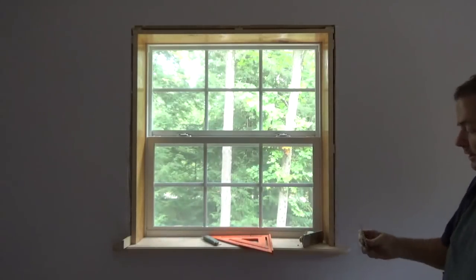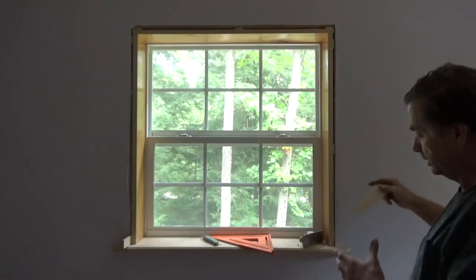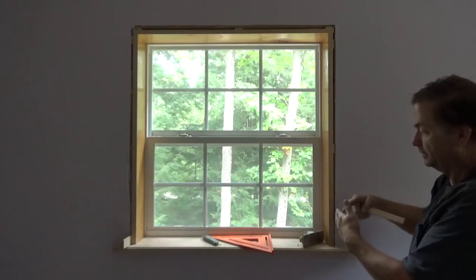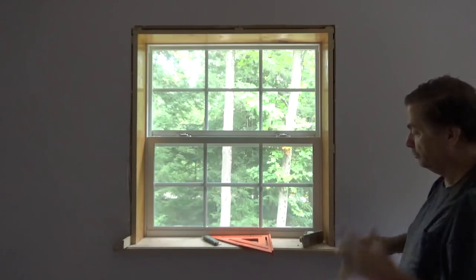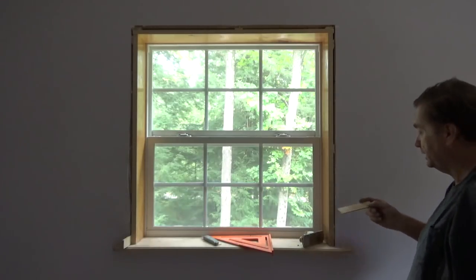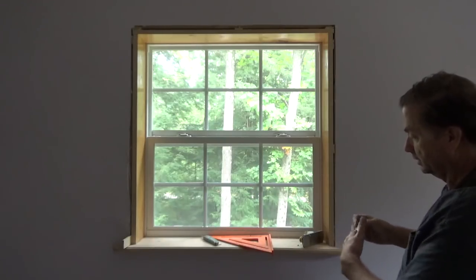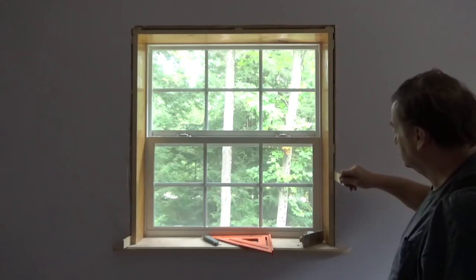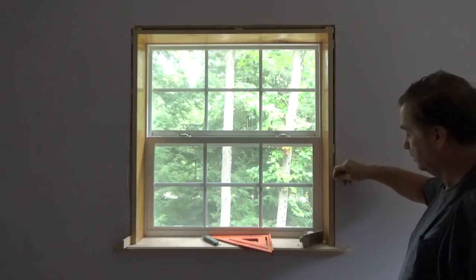Also, guys, there's an exception to every rule, and here's one of the things. Sometimes the board, the framing member, is crooked, okay? It's rounded, sometimes it's cupped, sometimes it just is cut on a bevel, and that's from the sawmill. And not just my sawmill, I'm talking about any sawmill. So even though shims are made to work opposing bevels, it does not mean that you don't put them in the same way. It's not a rule. It's the way that they were designed to work.